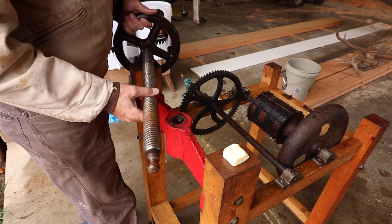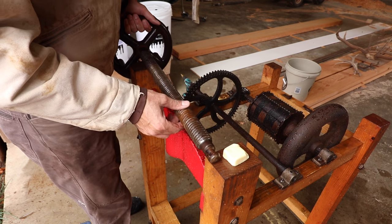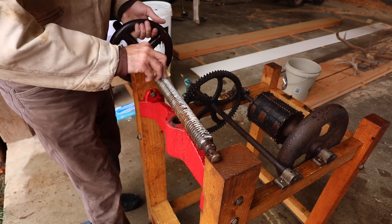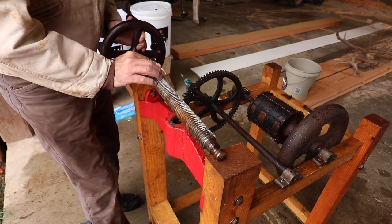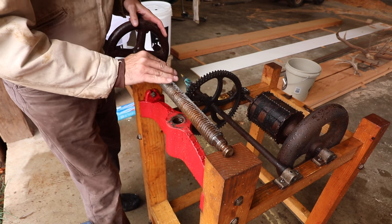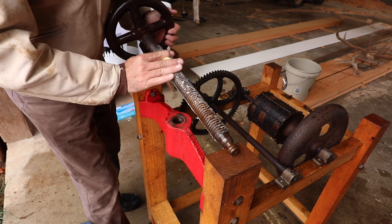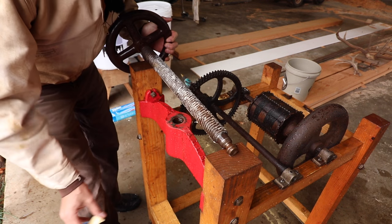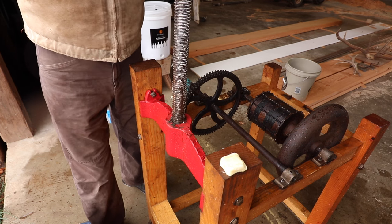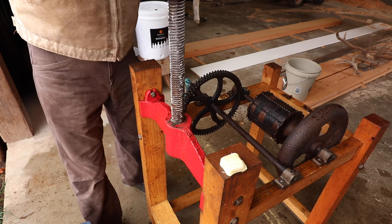Now we can put the screw in. Since the screw is going to be right over top of the press barrel and going into the juice, we want to lubricate it because there's tremendous force on it. We don't want to use grease or oil because anything we use on there is going to fall right into our juice. So I just take some butter — you can use butter or lard or anything that's food grade to lubricate this screw. On the old big presses, they used big screw jacks with hand-carved wood threads and lubricated with lard. I used hog lard before and that worked good, but I do have some butter. Make sure to rinse it out after because butter will go rancid, but we're ready to press.